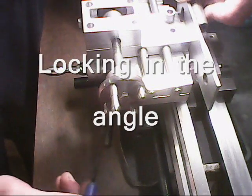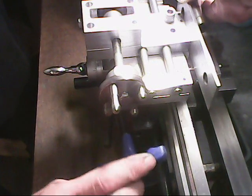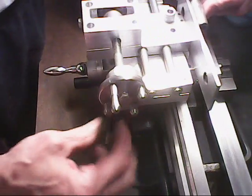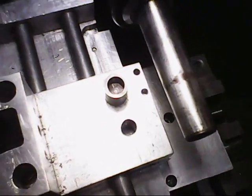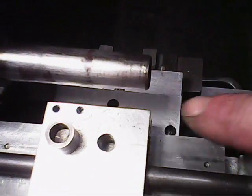I can now come down here where the lock screws are and just tighten it like this. All of the adjustments are done from on top here while I'm adjusting, and I can also adjust down here to lock it in position. There's no need to pull anything back. It's just a matter of getting it lined up and locking it down here, and we're ready to go. And there is the gap. Now I'll put my cutter on there and follow it through here to see if there's any fine adjustment needed.